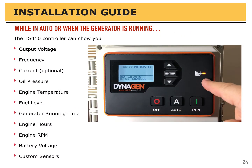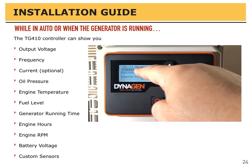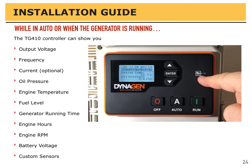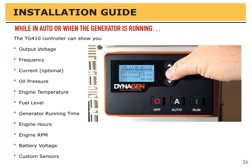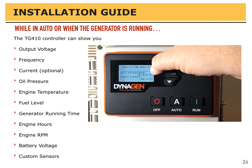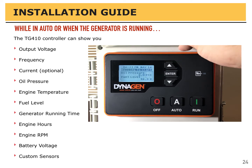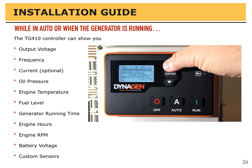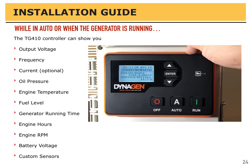When the generator is running or in automatic mode, you see a few screens scrolling by, and they show you things like the output voltage, generator frequency, current. It's optional because it requires current transformers. That's an accessory you can have added to your generator. Oil pressure, engine temperature, fuel level, generator running time, engine hours, engine RPM, battery voltage, and custom sensors, if you have those installed, any other temperature sensors or some other accessory.